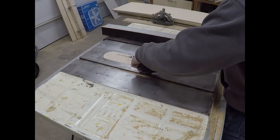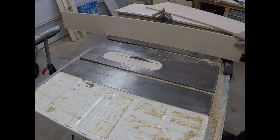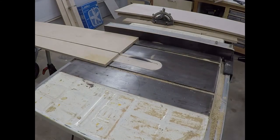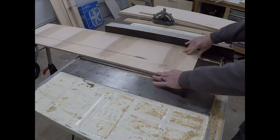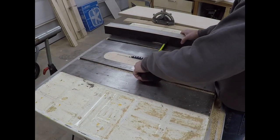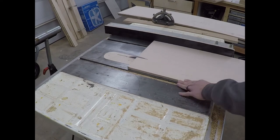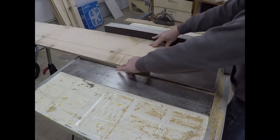The first thing I do for this project is set up my saw to rip down all of my pieces. I cut the top and the bottom out of 5/8 inch Baltic birch, cut them to 35 inches by 8 and 7/8 inches. The roof will be two half-inch pieces, 24 inches by 10 inches. I cut the sides out of half-inch Baltic birch also to 36 by 9 inches. The last rip cuts will be the shelf boards — these get cut out of half-inch Baltic birch to 35 inches by 8 and 7/8 inches.